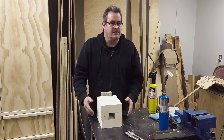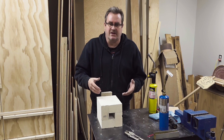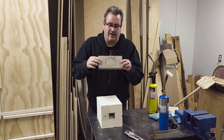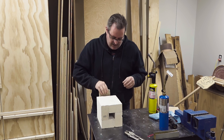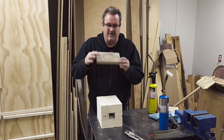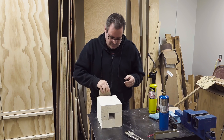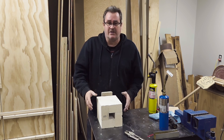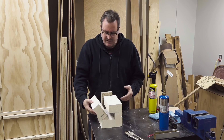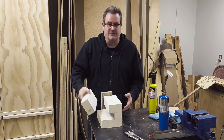As for where to get these bricks - I'm not sure you could get them at a building center. You can get the harder type there, but those don't insulate as well and are used for wood stoves or fireplaces. The better place is a pottery supply store - they sell these bricks because this is the type that goes in kilns used to fire ceramics.